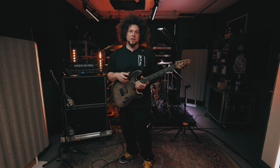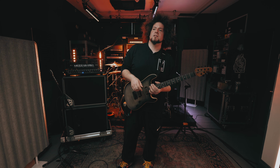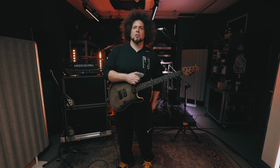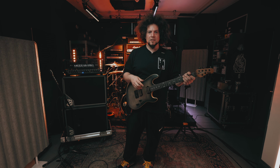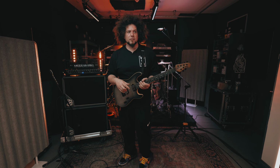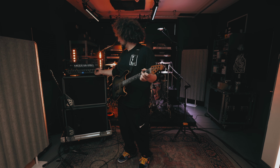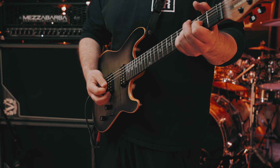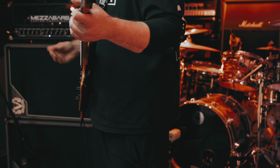I'm going to mess with the voice control now, messing with that negative feedback, because it's obviously going to change the overall sound, but with a sound like this, we should be able to hear what kind of influence it's having over the amp. So I've taken off the reverb and delay, a bit easier to hear what's happening. But this is the voice, or the negative feedback, all the way down. Now throw it the other way, all the way up.